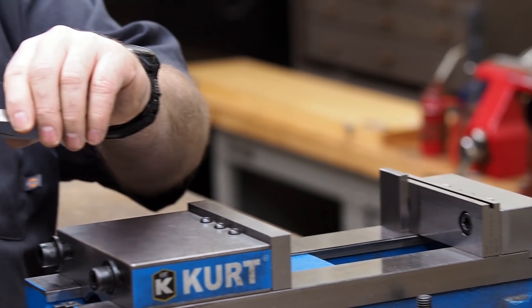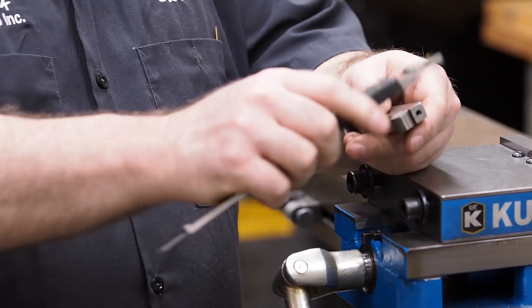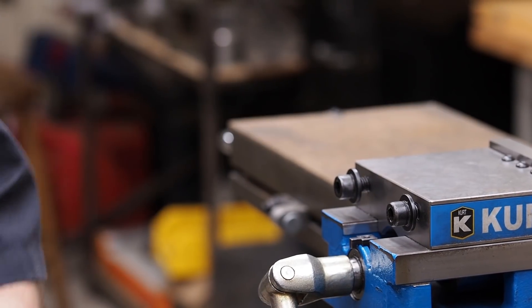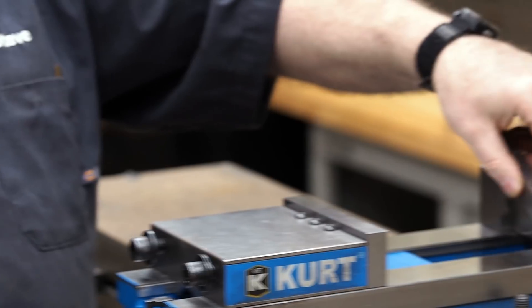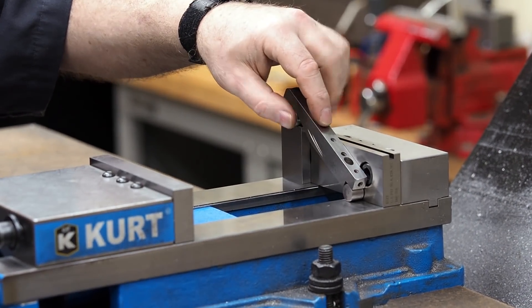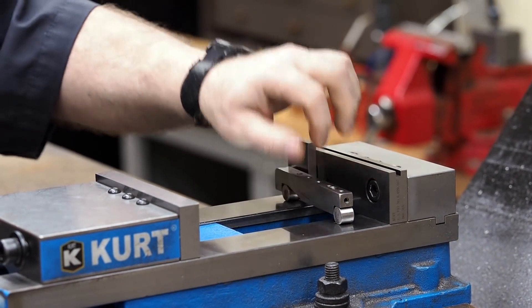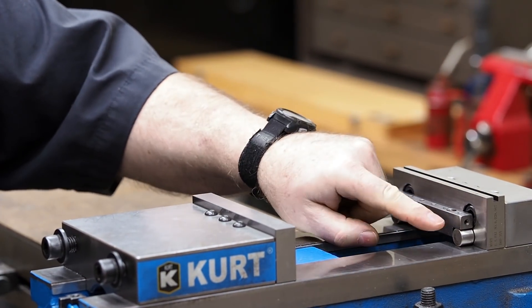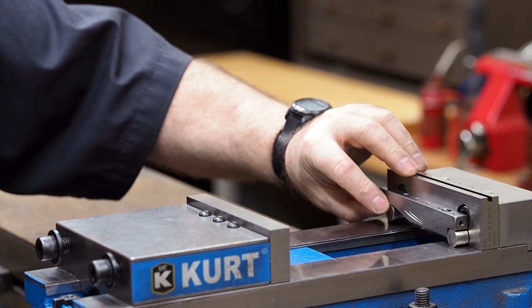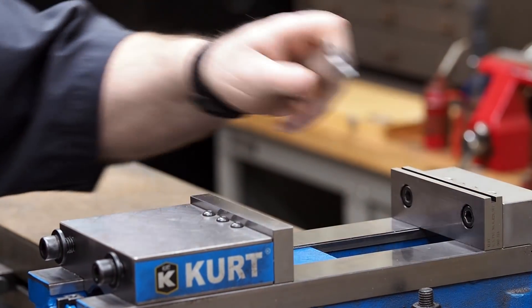Because this one is one inch and about fifty thousandths in thickness, it doesn't leave a whole lot of room to clamp your part in the vise. If it were a lower profile — at one inch and fifty thousandths with a two-inch vise jaw — even with low angles, it doesn't leave me a lot of room and is very limiting to where I can clamp.